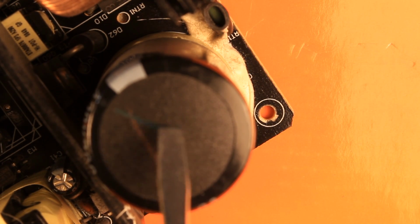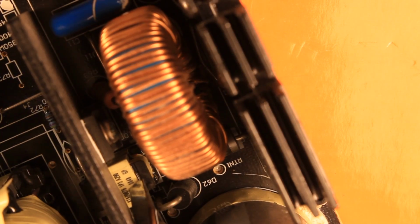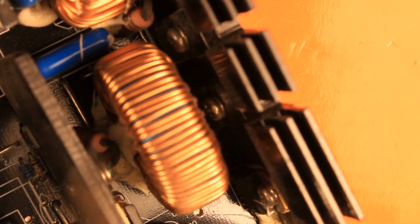And then here there is a high voltage diode, which is the recovery diode, through which the filter capacitor is being charged. This way, via this power factor correction, they can minimize the inrush current and also produce a lot higher power factor, meaning that there is not much power being rejected going backwards towards the wall plug. This really tiny transformer right there is actually the driver transformer giving the signal to the gates of the two field effect transistors, which are responsible for the power factor correction.